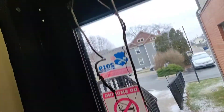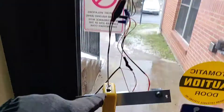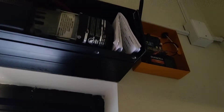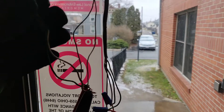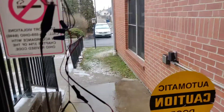My boss wired in the PDK years ago and doesn't remember how he wired it, so he pretty much told me to figure it out. I've never really messed with this stuff before. I just have to figure out how to get this through here to the new door lock. There is a relay wire, normally open, and it goes up into this lock. The relay wires are spliced together - one goes back into this lock and the other goes in here to actuate the door opener, because it's a handicap door.